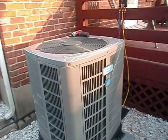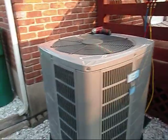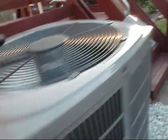I got my saturation temperature — you know the drill. I thought I was kind of tuned in. This American Standard heat pump here requires 10 degrees subcooling, and I can be plus or minus 3 on it.